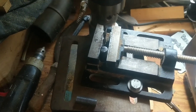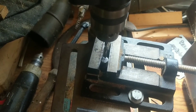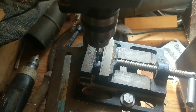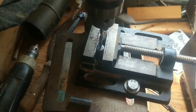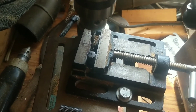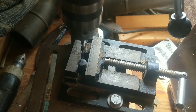The plan is we're going to — I've got this drill and tap set with the proper bit for it. Got it all centered. I'm just going to drill this all the way through, because there's no point in not going all the way through — it'll make the chips clear a lot easier.